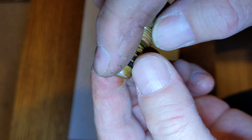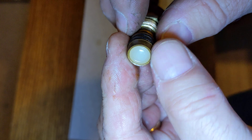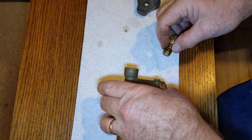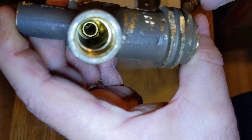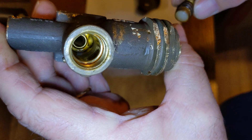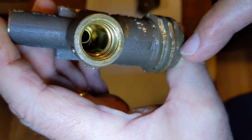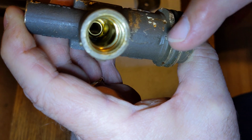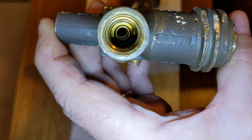That's what raises and lowers this little disc. You've got two o-rings on here to seal it, to prevent the propane from leaking back out through here. Then you have a little valve seat at the bottom, and that seats right down on top of there. You can see the port for the main line coming in, and then the center hole is going down into the tank.